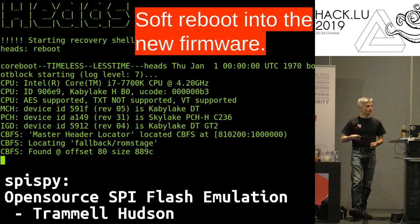The other nice thing is that you can soft reboot into this — you don't have to power cycle. This means it's much easier to build into a continuous integration pipeline where you can have new firmwares tested every time there's a git push.